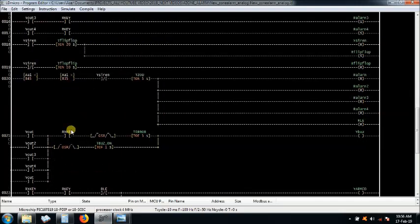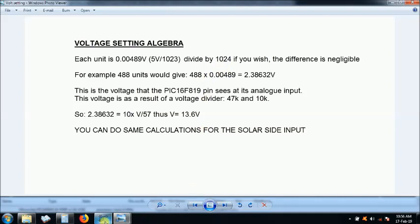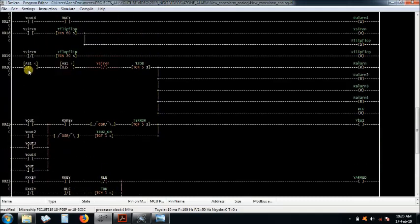For the key inputs, it's also a range — 375 and 365 units — using the same calculation to determine the voltage input to the microcontroller. However, each key has a different voltage range as you progress through the keys. Key one, key two, key three, key four correspond to different staged voltages: for example, key one maps to the range 845 to 835 units.